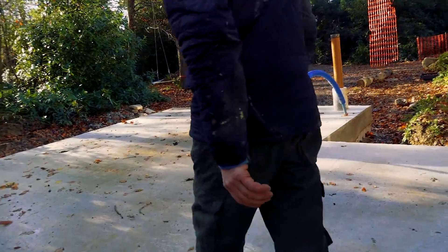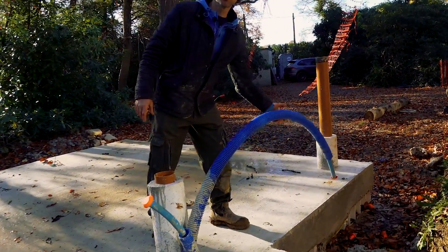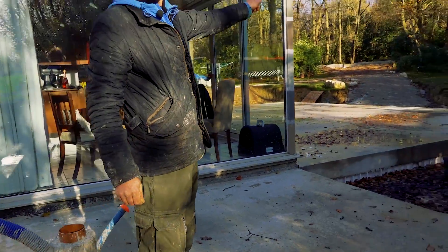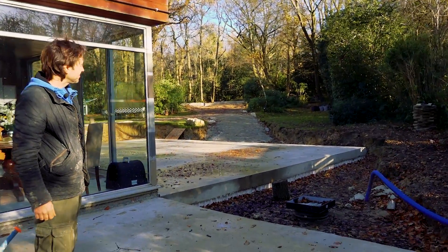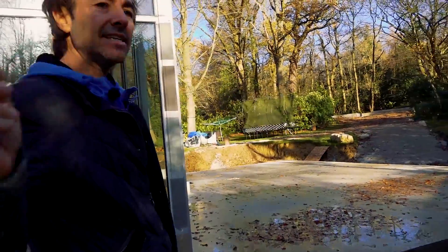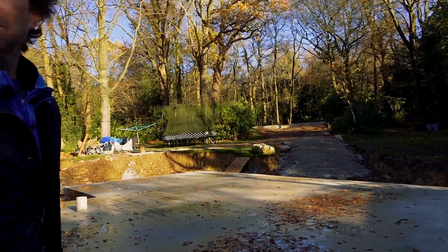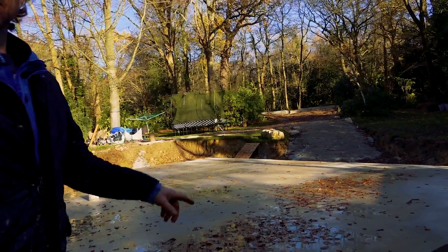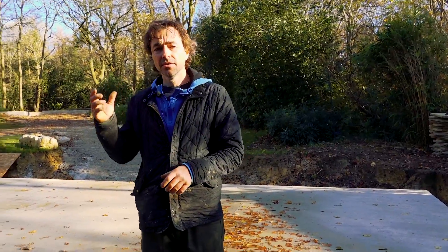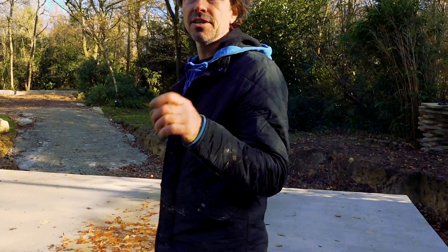What's this bit of blue coming up? We've got a new water main in, and then a water main coming out which is going to go all the way up the garden — about 65 metres — to the leisure room, the garden room. We'll use our small excavator for that. We're also running a 63mm gas main all the way back to the street, teeing off to pick the house up as well. We'll lay the pipe, expose where any joints are, then the gas board will come along, do the joints and commission it. They'll only commission it from out of the ground — we'll then take it up in cast iron barrel.